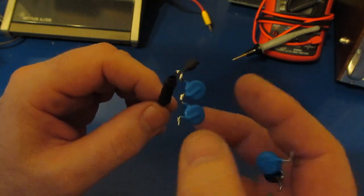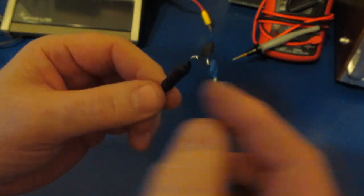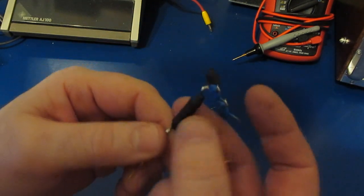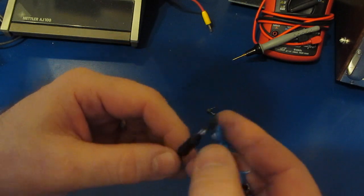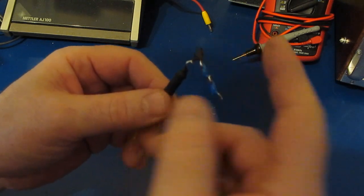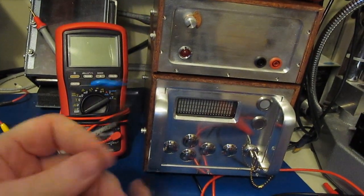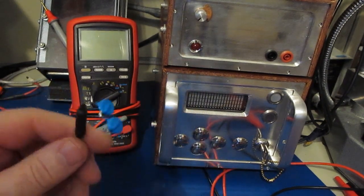If we're in a mode where the high-speed clamp is engaging, these MOVs are essentially shorted out. With smaller PTCs — those are a 5mm package — I've seen those actually blow apart. Once they're a dead short, on meters without a surge-rated resistor there's nothing to limit the current further, and all that current is passed into the high-speed clamp, causing those transistors to fly apart. On better meters you always see the surge-rated resistor, PTCs, MOVs, and then the high-speed clamps. I have tried to damage MOVs purposely with a transient generator and couldn't.